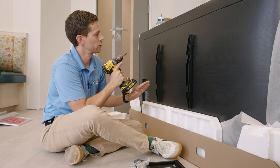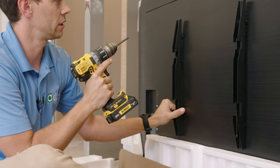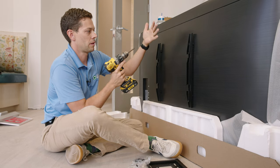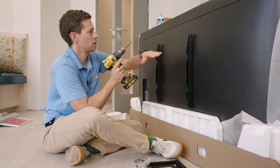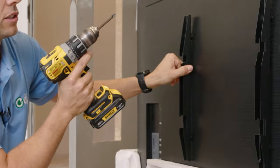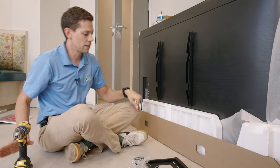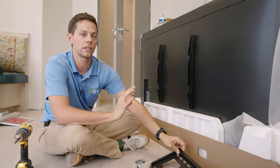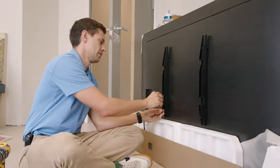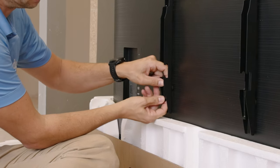When putting the brackets on, I pull them up as much as I can before tightening because the TV is going to hang on the wall — I want to push up on the bracket, not pull it down, since that's the direction gravity will act. There's also a little bit of slack in the bracket slots. As long as I pull both brackets up and do the same with each, they should be pretty close. Even if you get the wall bracket perfectly level, the small amount of play means the TV might not be perfectly level — but we can deal with that.